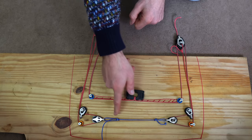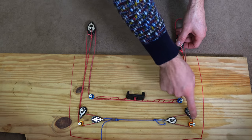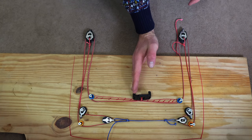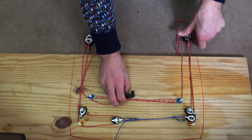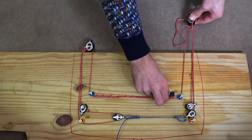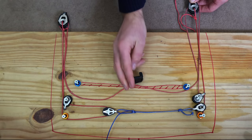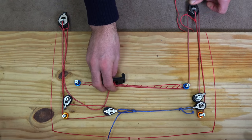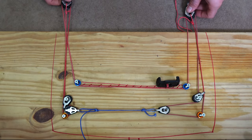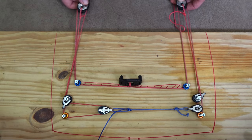This latest iteration works as a differential, so the traveler always drops to the leeward side once this block is out. Imagine this is the stern of the boat, the sail is here, and we're sailing on starboard tack — so the traveler wants to drop down to leeward. This differential works on a 3-to-1 ratio. If we replicate what happens in a tack: you've been trimming on this side, the boom is just off the centreline, you go for a tack — and this just drops down to the leeward side ready for the exit of the new tack. Then you just start trimming on this side with your 3-to-1. It works like a neat differential.